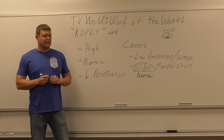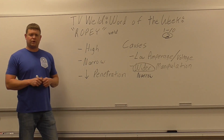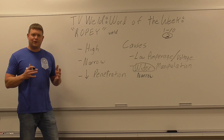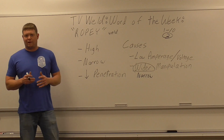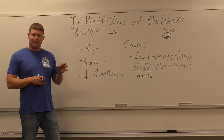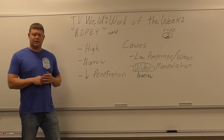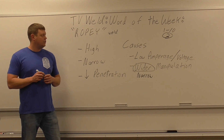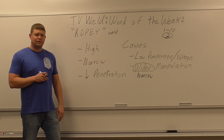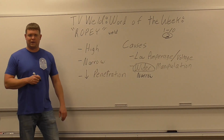What we're going to do is go out in the lab and I'm going to do a TIG weld, a MIG weld, and a stick weld. I'm going to turn the amperage or wire feed way down and try to make a ropey looking weld in all three processes, then put the settings back to where I'd normally run and run another bead. You'll see a high ropey weld versus what one should look like, and I'll write down the parameters — amperage, wire feed, voltage — on the plate. It's not a real hard thing to fix. Just turn your amperage up, usually.